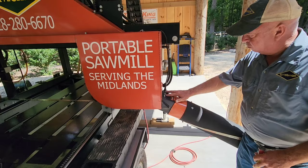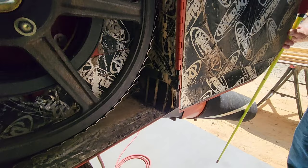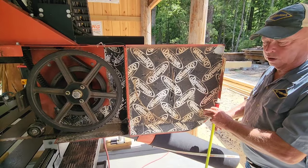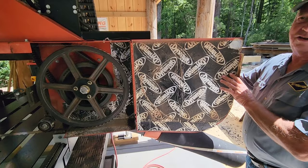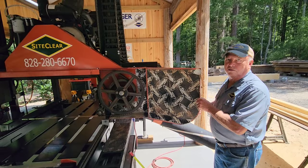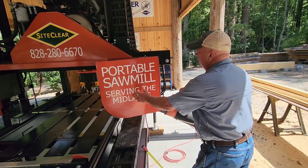I made up this set of guards out of 12-gauge steel. These extra bolts you see down here are actually the safety stops — those are quarter-inch bolts — and that allows a lot more sawdust to go out rather than get stuck in there. It doesn't clog it at all. What's all that material in there? This is Dynamat — a sound dampening material. This stuff is really kind of the difference between a Chevrolet and a Cadillac. They put it in your floorboards and door panels. No more rattling and banging. I did hear him run the sawmill earlier — it is much quieter than mine. I'm going to have to do something like this. It's absolutely quiet.